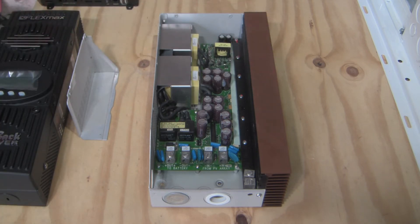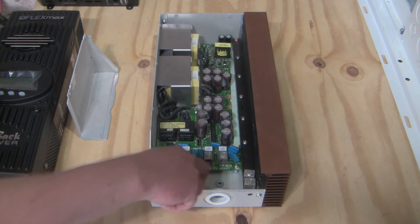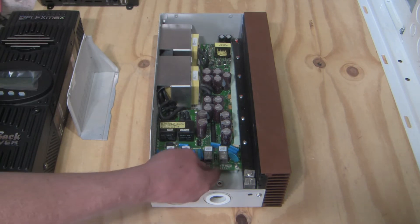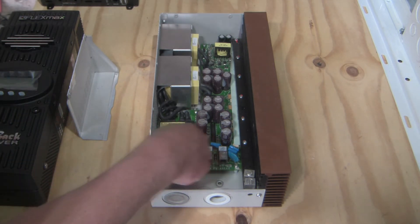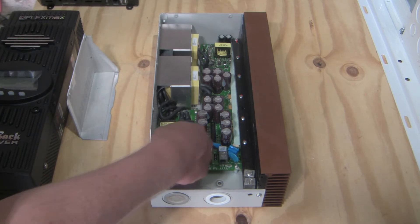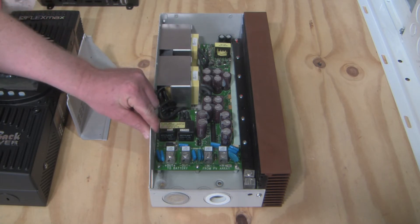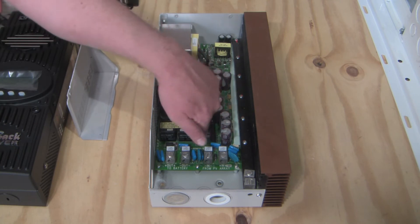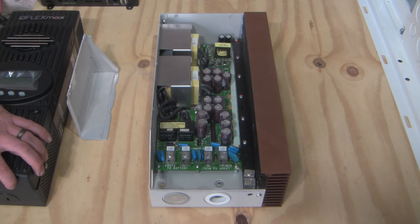They did have a flaw, and I don't know if Apollo ever realized what was happening. The flaw was if you hooked it up treating these as common negatives — just one negative going to your switchgear without a separate negative going to your PV or battery — if you tried to share these like with an Outback controller, it would cook some kind of surge protector right in the middle and just fry the controller. I found out by doing it and breaking one. It worked for a while with a smaller solar array, but once I expanded the array it fried some circuitry. They actually repaired it — they had great customer service while they were still in business.